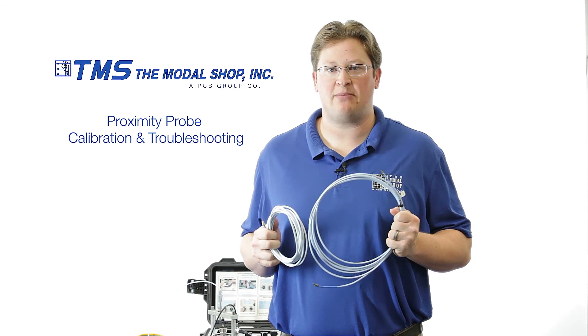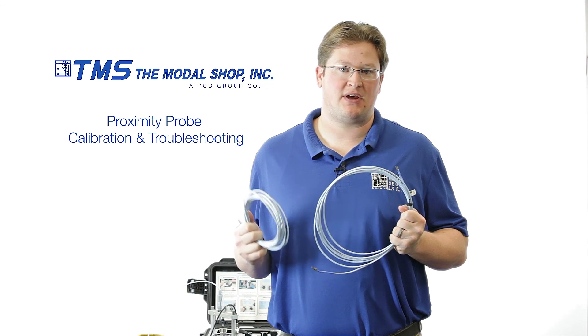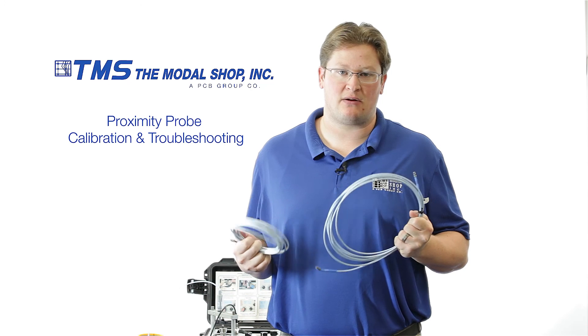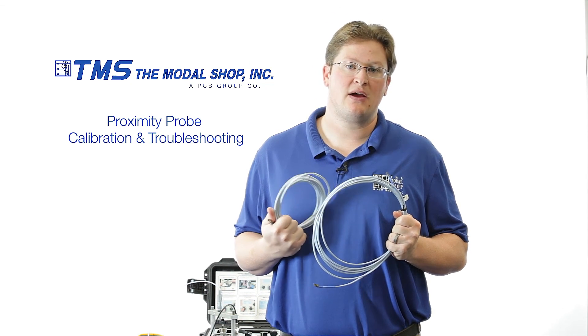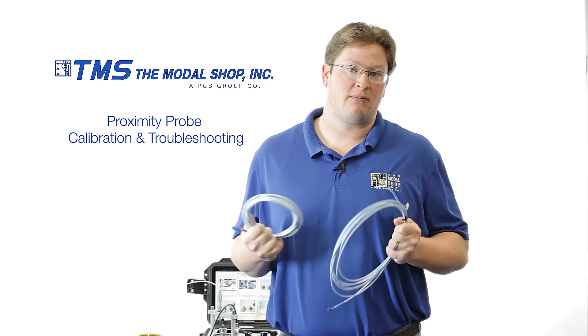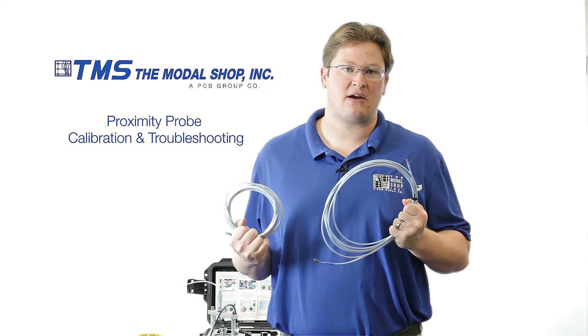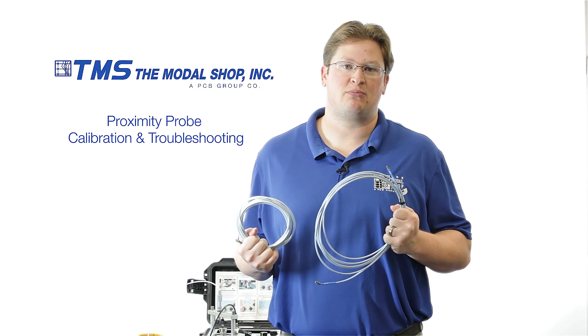You can see how a cabling error can easily occur. This is my four meter extension cable and this is my four and a half meter extension cable. They're the same color — I've coiled my four meter extension cable a little tighter just so I can tell the difference quickly without finding the model number — but they have the same color and the same connections. This type of mistake upon reinstallation of proximity probes can affect the dynamic output of the sensor.